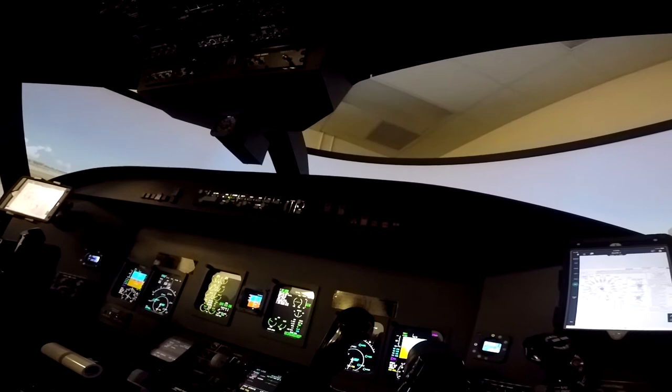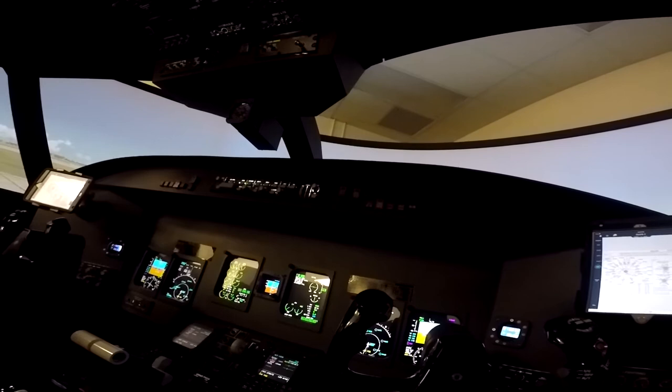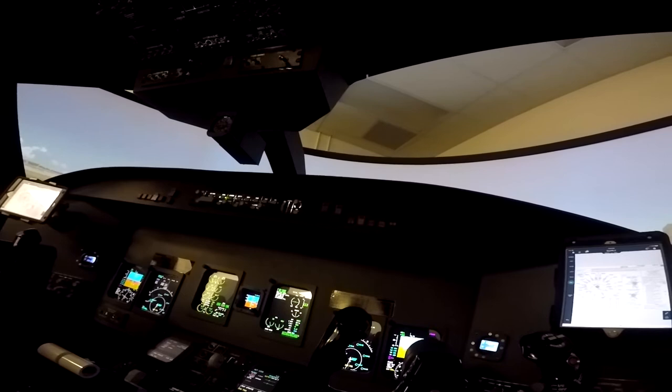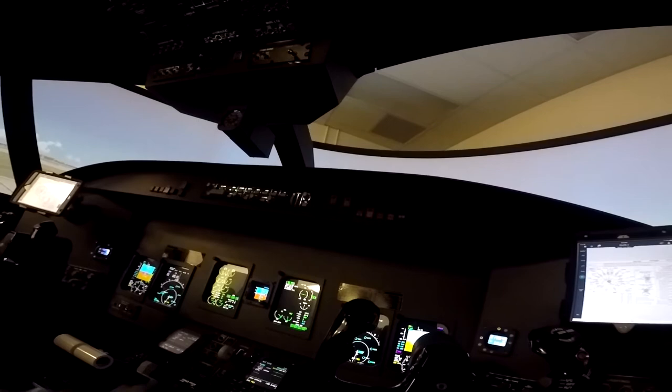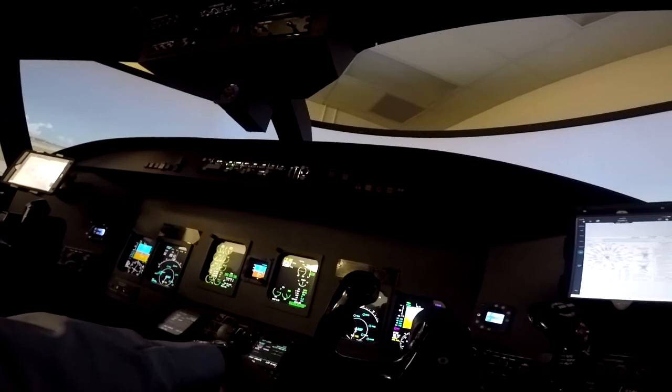Wait for the center and then hit door closed. Generally I just wait for the RPM specifically. The RPM countdown comes out at about 45, and then you turn off the closing door. You'll still get an alarm saying the door's closing, but that's fine. We do the second fuel check valve on the last landing. We come in and land, we do the fuel check valve. So on our last landing, we'll kill engine 2 and only test engine 1, and check the valve on that one. Okay, exit door closed. It'll just cool down over time.